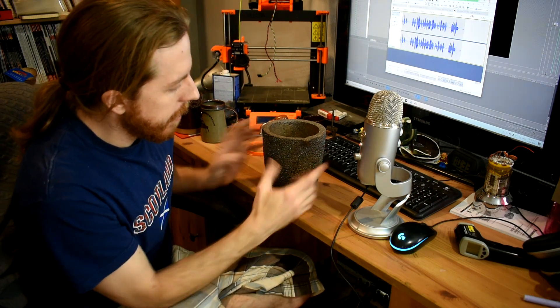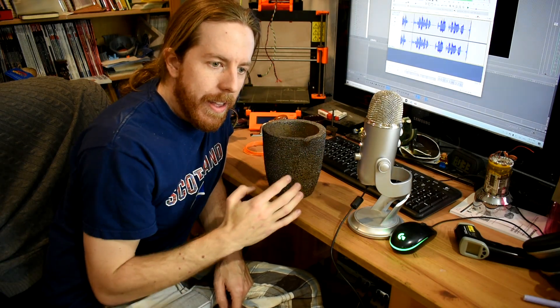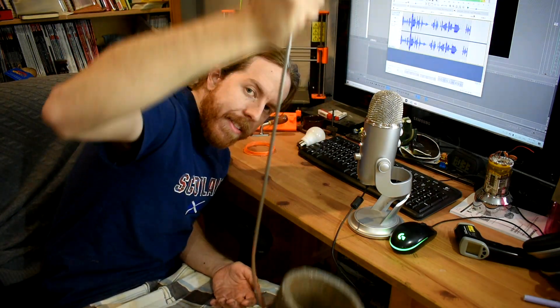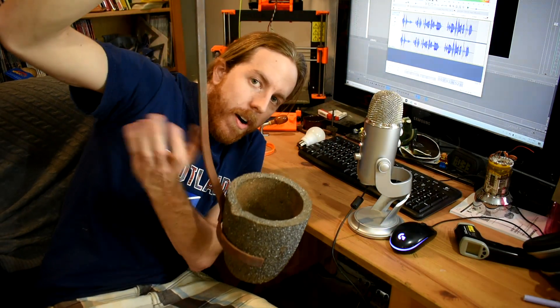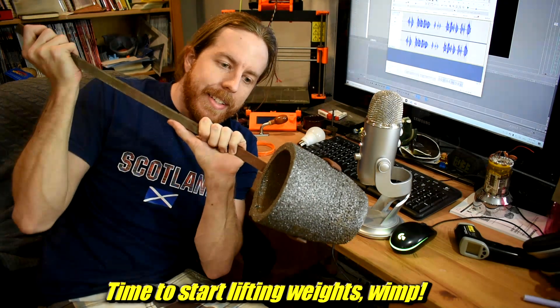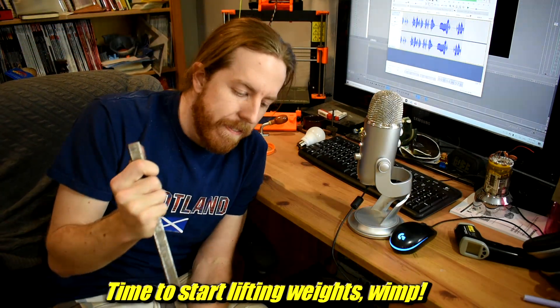The center of gravity is about here. When it's full of metal it stays down low. A contraption like this holds it and it's very nice for lifting — you can lift it up because the center of gravity is hanging straight down. All I have to do is pick up the weight. But to pour, I actually have to lean it over, so I'm lifting and pulling down with my other hand to tip it. I have to put in quite a bit of force to lean it over. If this were heavier — if the crucible holds twice as much metal it's going to be twice as heavy — that might become a bit of an issue.